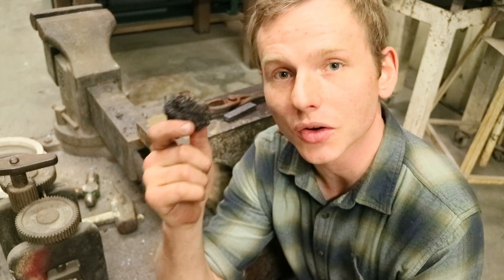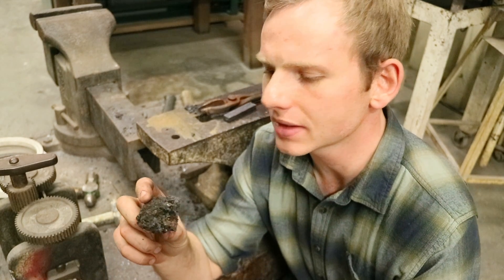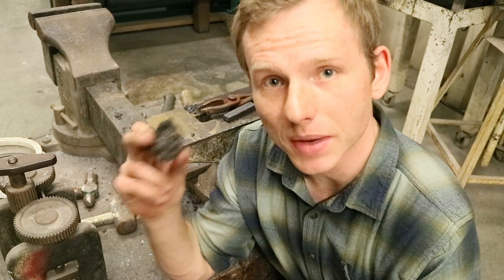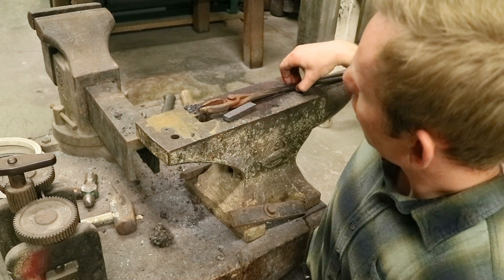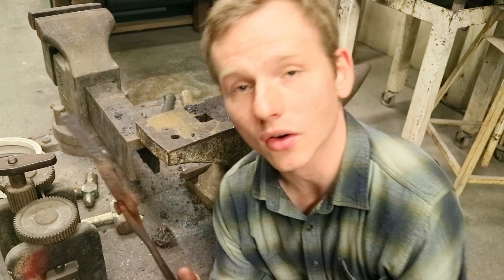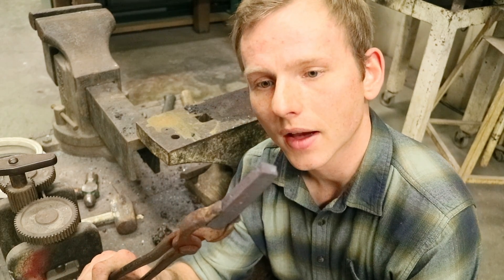So what we've learned is that the bloom material from the smelt with granite is not actually iron — this is the stuff from the previous episode we did on 'is it iron?' And the answer to that question seems to be no, so it needs to be smelted again. This is basically just extremely iron-rich slag, fayalite. We did manage to forge a piece of iron bloom from the previous smelt where I used 100% pure iron oxide, and got it to work. So apparently I can indeed make iron from scratch and make it into a bar. I just can't do it with the ore I've tried up to this point.